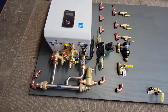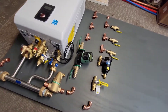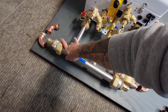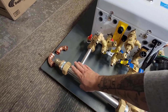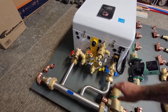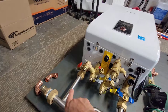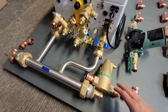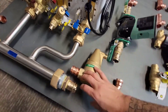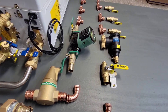What I have here is everything laid out in the pattern I'd like. You'll see it all come together as I continue building. Right here is where the unit feeds the hot supply for the heating system. I'm going to loop this over here and it'll come in this direction feeding into the air eliminator, which gets all the air out. Off the air eliminator the expansion tank will be hanging. This is just a general mock-up of how I'll be laying this out.